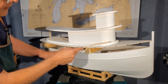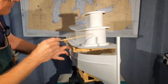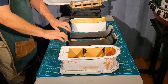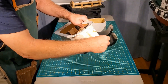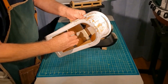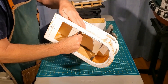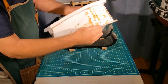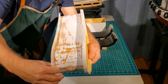The next fiberglass part is the main superstructure, which is attached with screws onto the hatch. Here's the superstructure plug, the two-part superstructure mold, and a superstructure. The base for this plug was made from one of the hatches I made from my hatch mold. The basswood is covered with resin, a little bit of gel coat, filler, and so on. It's prepped up nice and smooth, and the hatch formed a flange here. I made a flange to fit on the top with a slight angle so that it can be removed from the two-part mold.